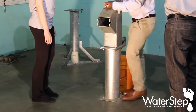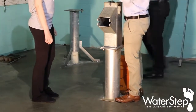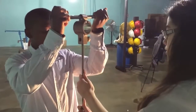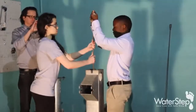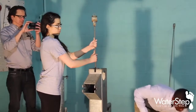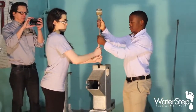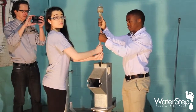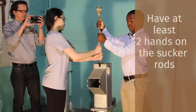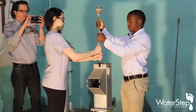You may have to pull up a little bit to get it started. Then have your person working with you grab hold of the sucker rod with both hands. Slide the wrench out and lay it on the ground so it doesn't fall. Safety is real important because you don't want that wrench just to hang up there. You always want to make sure that you've got several hands on these as you're pulling them up, because the last thing you want to do is drop this back down the well.